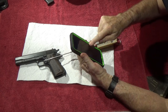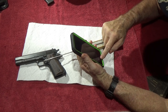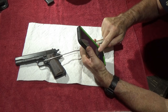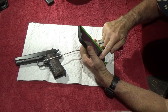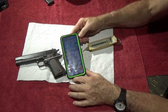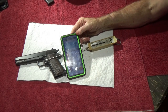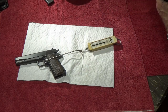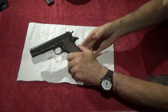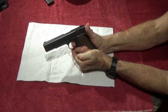Do the math: 50 ounces divided by 16 ounces per pound — that's 3.125 pounds. With a couple of readings going a bit higher, it's about three and a quarter to three and a half pounds. I'm happy with that. Three and a half pounds on a carry gun or a farm gun is very good. The take-up on it is nice too.